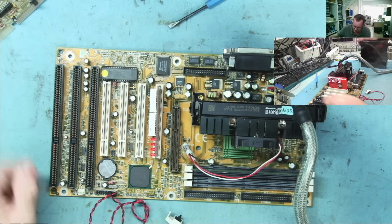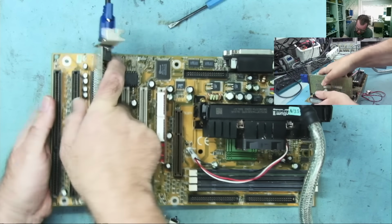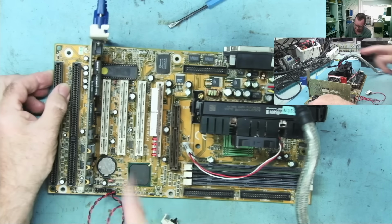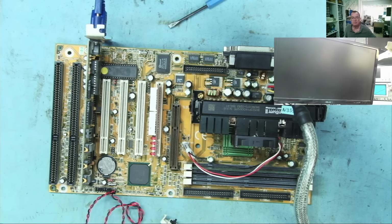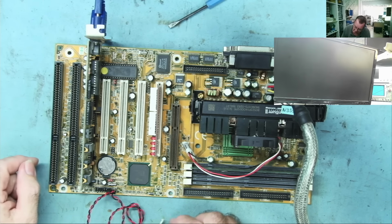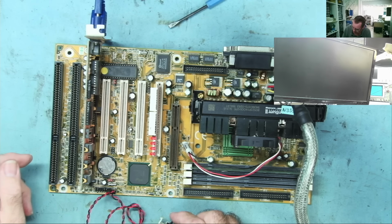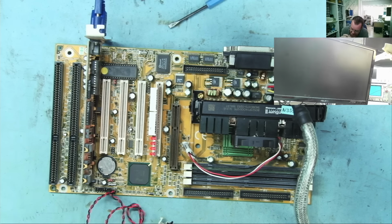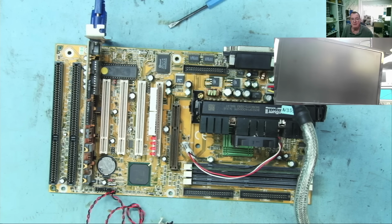Okay. Put the graphics card in. Put the ISA one back in. See if it gives a picture or not. Power on. Start. No, so this one goes to C5, but doesn't actually give a picture. So it would appear that none of these BIOSes actually work on my board. Two don't boot at all. This one hangs up with a completely different code than we had previously.